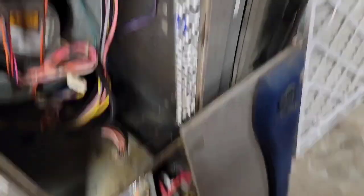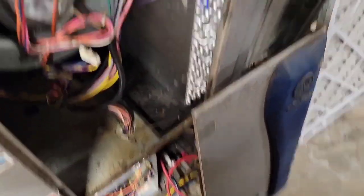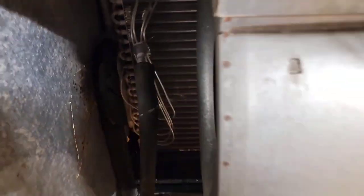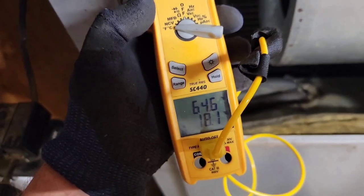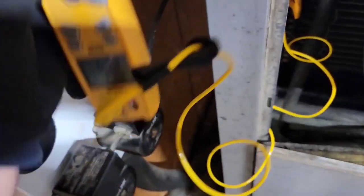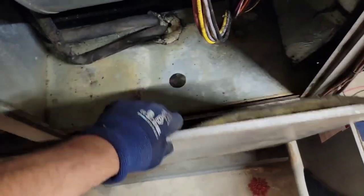175 — that's super high suction. I should have plenty of refrigerant, but I could have a TXV issue. No TXV here; looks like an aluminum distributor. Clamp on the suction line and the evap.